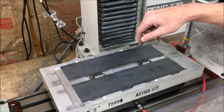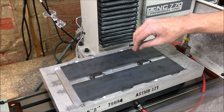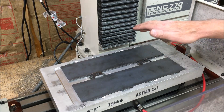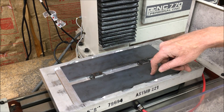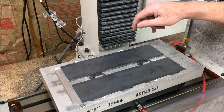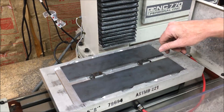So when I tried using the feeds and speeds I was using before, it just wasn't working. There was too much noise, squeaking, chatter. So I kept on backing off. I was at like 5,000 RPM at 30 inches a minute, and that was doing okay. I watched a post by John at NYCCNC on his Instagram where he was doing 2,700 RPM at 8 inches a minute, and that looked like it was chewing it up. I tried those recipes and they weren't working. So I decided to try something new.